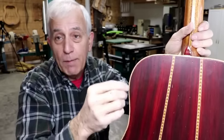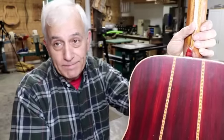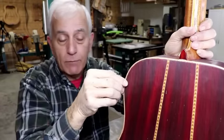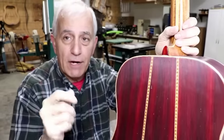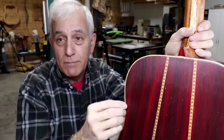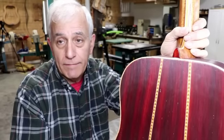A new guitar with new binding, you might get the binding off and put it back, but generally you can tell it. This new guitar with more or less new binding, because it's wood binding, I can make a replacement. I can route all this out, I hope. But the problem is tear out, you know, and I don't know if I'm going to get tear out around where the binding is glued to the wood, to the back and sides. If I don't get too much tear out, we'll be fine. If you get very much tear out, it's a total disaster.